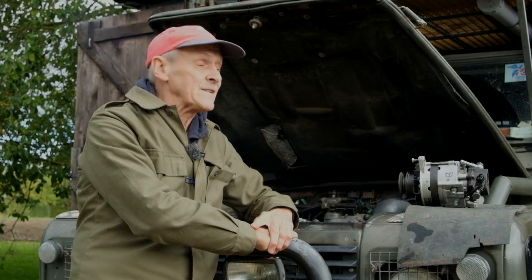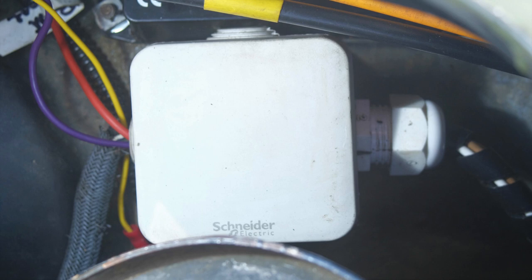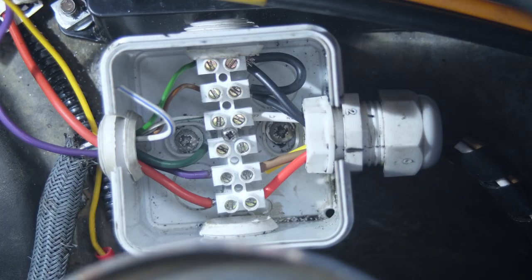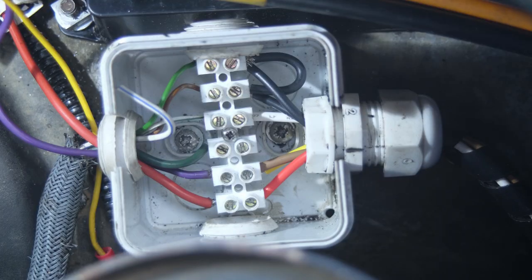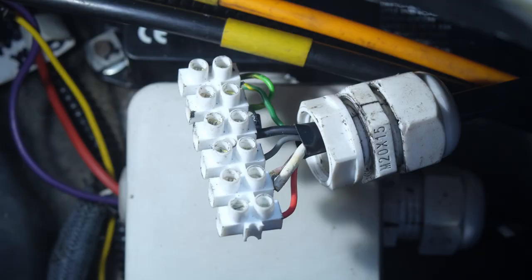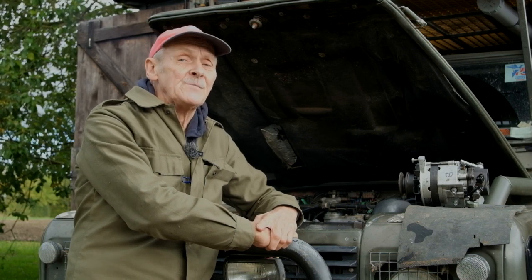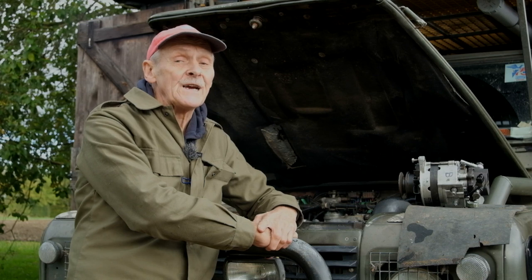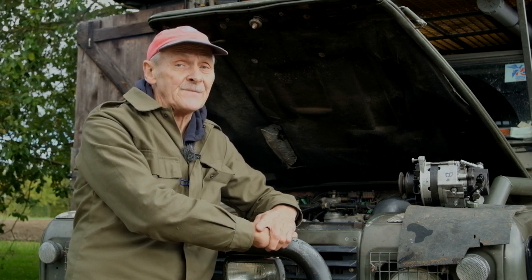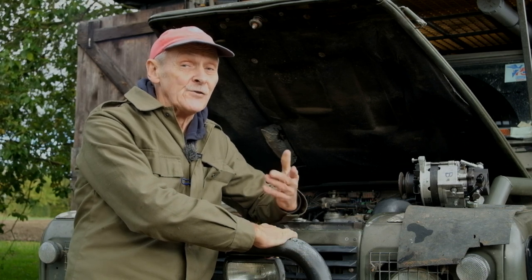The whole system comes together inside this junction box here, which is the interface between the alternator and the charge controller, with a six-way terminal block. I've also got an identical terminal block on the spare Driftgate unit, and should I need to change out the charge controller, it just means moving the cables over on the alternator side like-for-like — this only takes a few minutes in practice. At the end of the day the system is now working very well and should be reliable.